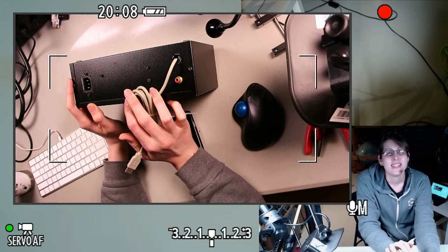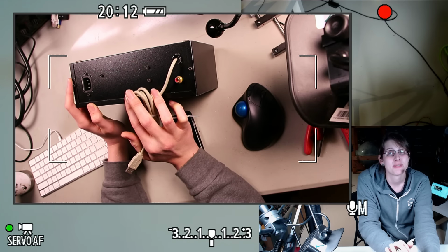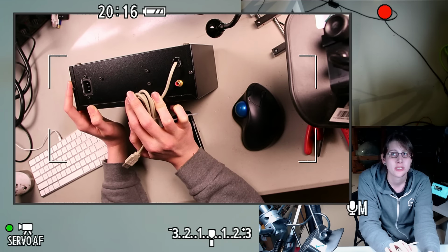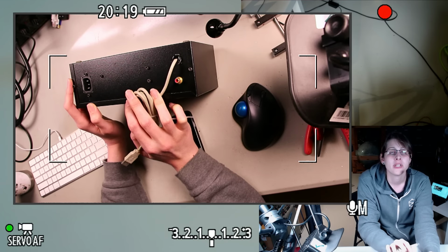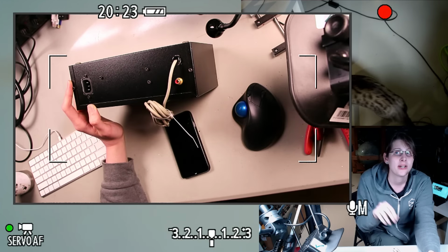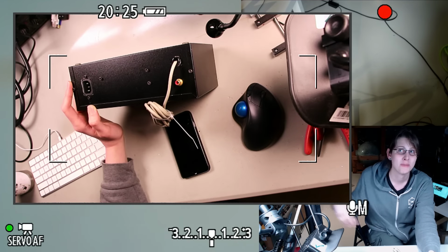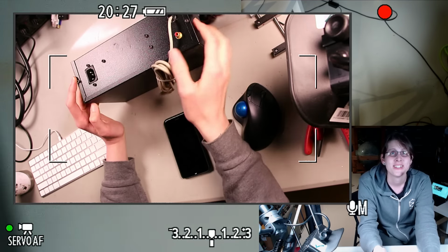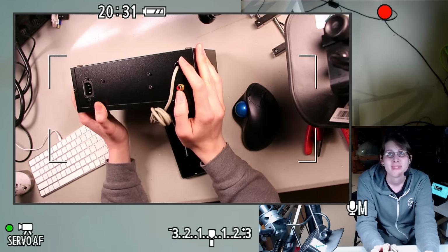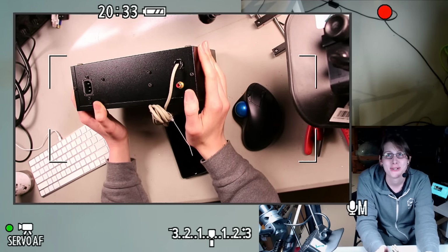And I think the VFD plus the infrared transmitter especially would have drawn more than that, because I think the IR was maybe 100 milliamps or so on its own. The IR transmitter is external. This RCA jack leads to just a little IR doodad, or a Y cable with a bunch of IR LEDs, so that you can transmit control codes to your Laserdisc player or whatever.